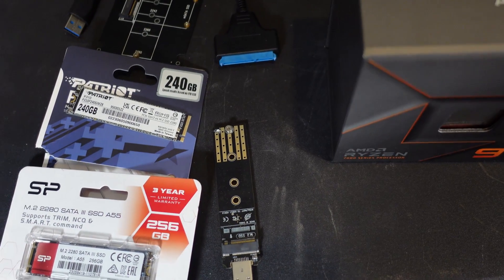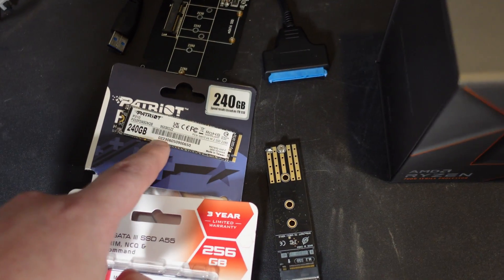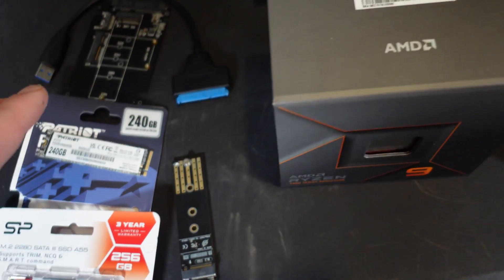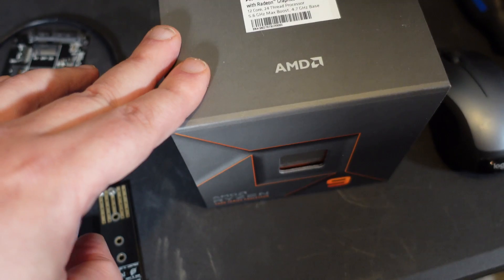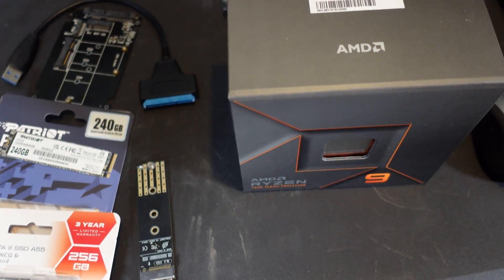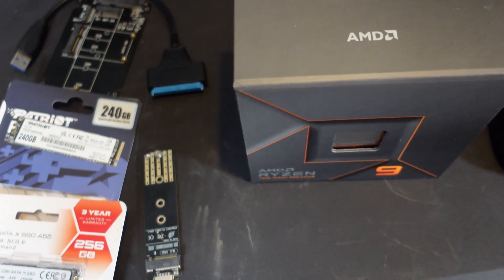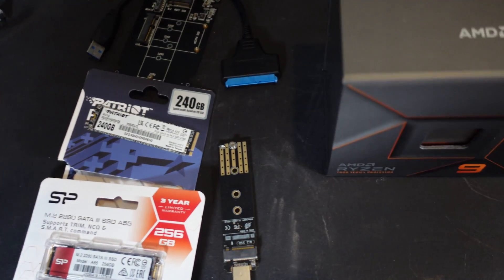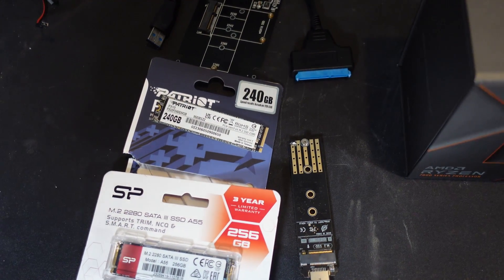I already flashed HiveOS into the drive — that's the M.2 NVMe right here. In order to get temperatures within HiveOS you're going to need to use the beta version; it's not yet in the latest stable version. So if you already have a 7000 series and you're wondering why you don't get temps, make sure you change over to the beta version.